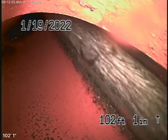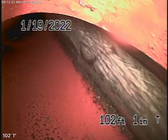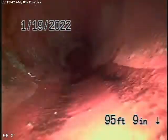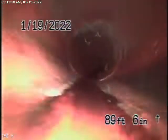Right now we have our camera in from the roof vent and we're all the way out to the city connection in the street. There's the city sewer flowing by — there's your connection to the city. You have a 6-inch clay pipe coming back from the middle of the street towards the property, and this actually appears to be in pretty good condition. It's nice and clean — no roots, no major breaks.